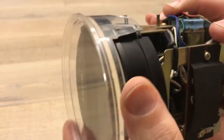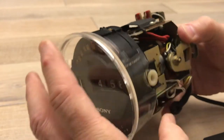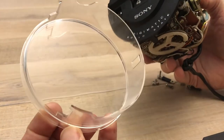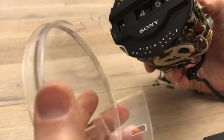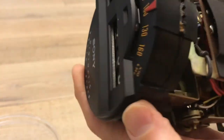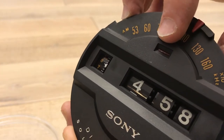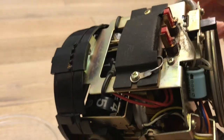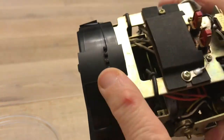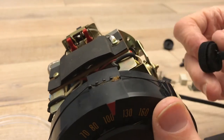I'm going to depress the black piece and lift up a little bit on the clear plastic, taking my time. It is a little forgiving and it came clear just fine — we've got a nice scratch-free specimen here. They do scratch so we have to be careful. You can see what looks like an indicator light — it looks like red plastic or red glass — but I assure you that is not supposed to light up. It's all decoration. When you take these apart you can see there's even tape over it to stop light bleeding through from the clock face light, which is just an orange neon glow bulb. Here's our tuner — you can see the string pulling it side to side.